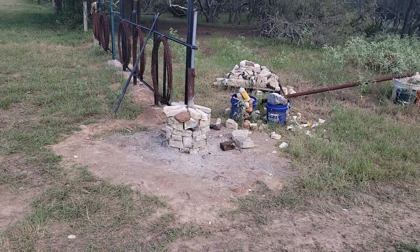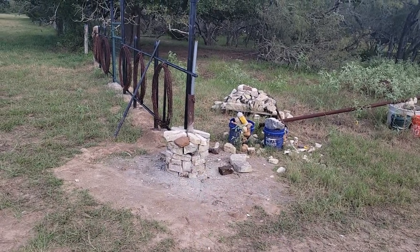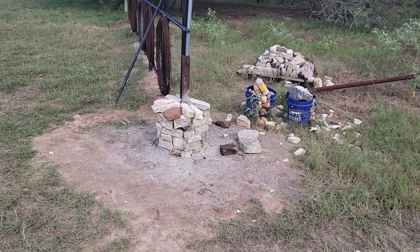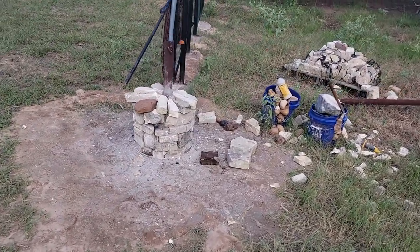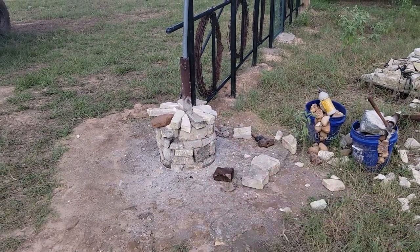But anyway, I want to build a whole wall out of this idea of stacked stones and then pouring concrete in there. I honestly don't think that is structurally strong enough. A post with rebar in it, poured concrete in the bottom, I'm okay with it. The limestone wrap around the outside isn't structural. It's just a facade. I think it looks pretty good already. And I'm not done with that capstone. Once I get done with the capstone, it'll look really nice.